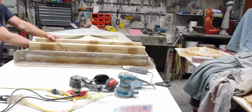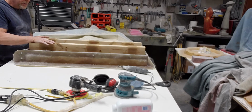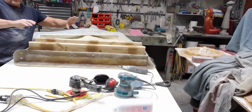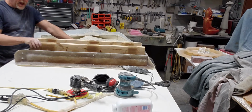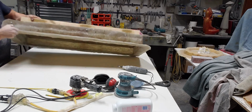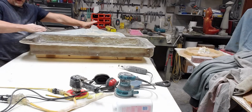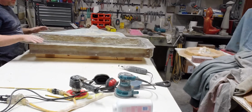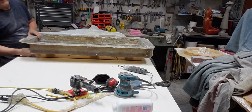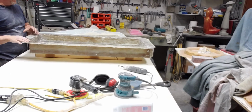While your mold is still inside, while the concrete model I had is in, that's when you put the glass on. The reason you're putting the glass on is sometimes in a large mold, they can twist and kink, and you don't want that happening, or else you can never level out your mold. You know what I mean? Your bench, you go to screed it and smooth it out, and you're always going to have a bit of a twist in it, and you don't want that. It just won't work. It'll look goofy on the top, and the sides won't look right. So that's why it's really important to reinforce it, either with some rebar or put these 2x4 legs on.